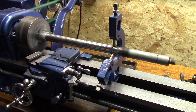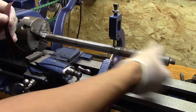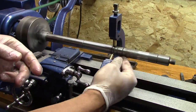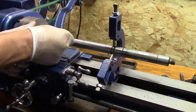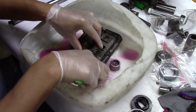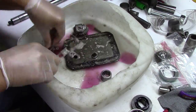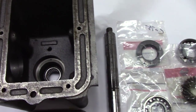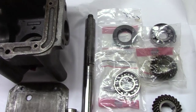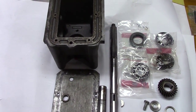On one side of this main shaft it was pretty pitted. So I got it chucked up in the lathe, put a steady rest on there, and decided to polish up the pitted side — it really turned out pretty nice. You can still see the pits, but the rust is out of it. Now it's time to give the inside a bath and get that baby all cleaned up. I grabbed the Purple Power, a toothbrush, and the WD-40. Here she is, kind of cleaned up — all that oil's out of there. Here are the parts, the new seals, and it's time to get her painted and put back together.